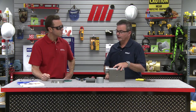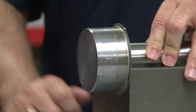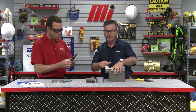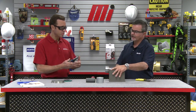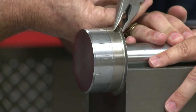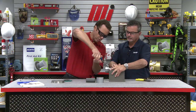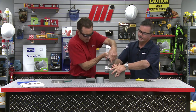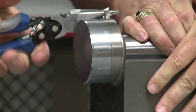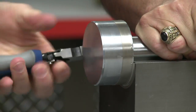If the flange was cut for removal, simply use a pair of long-nose pliers, grasp the flange away from the sleeve, and twist it in a coiling motion. Tom gives it a try and twists the flange off — it comes away easily, like peeling a can of sardines.